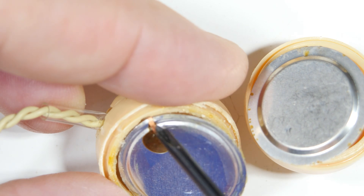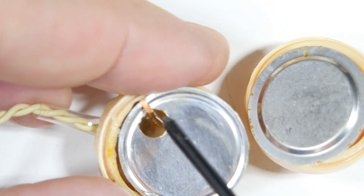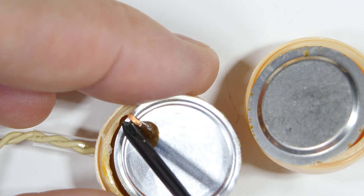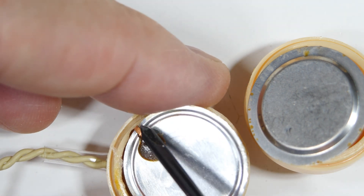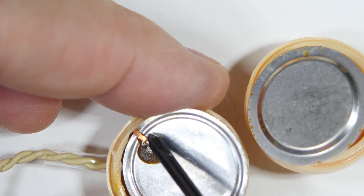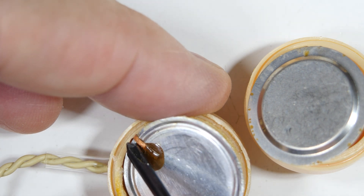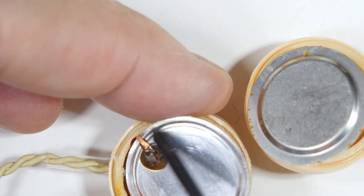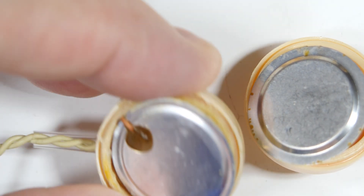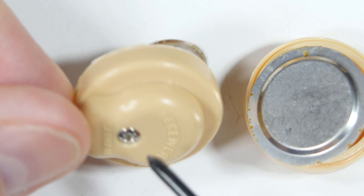The edge is sharp, and I'm guessing that what happens is over time the aluminum — as aluminum does — oxidizes, and you have dissimilar metals: copper and aluminum. It oxidizes and therefore the sound goes away. Then when you shock it or bang it, a couple of people said they can bang it and get the sound back — you scrape enough of the oxide away to allow for an electrical path.